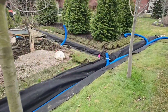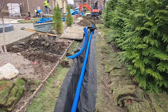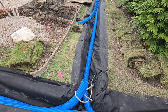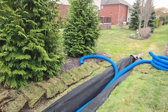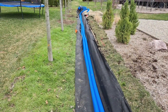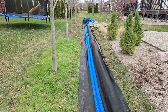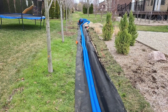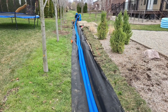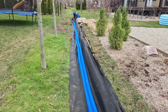You can see with all the landscape how the water just gets trapped in the swale — there's just a small green belt left, not much. The guys are going to have that solid pipe for the roof runoff, they're going to tie that catch basin into it, then they're also going to have a perforated pipe in that trench. They're going to grab all the water and send it to the storm drain. They have two perforated pipes. Water doesn't flow through grass very well — there's plenty of slope here but this is not concrete or asphalt. Grass really holds water up, so that's why these french drains expedite the process of draining your yard.